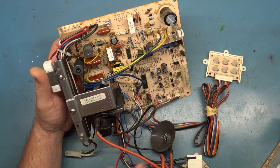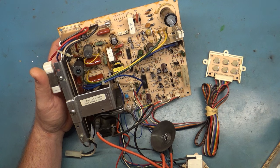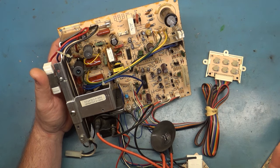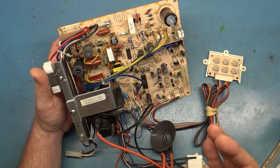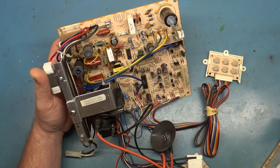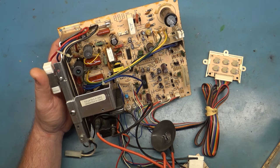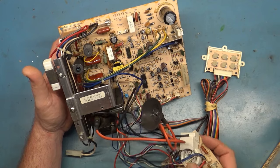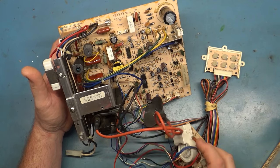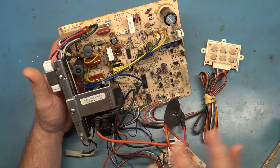I talked to the owner and asked him if he was also getting the blue screen with the retrace lines — technically retrace lines, not raster lines. He said he didn't know because he couldn't keep it on long enough to get the screen to come up, because the resistor would immediately turn red hot and start smoking within three seconds. But on my end, it only ever got lukewarm or warm to the touch — not anywhere near what he was describing.